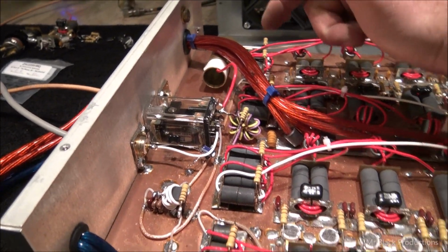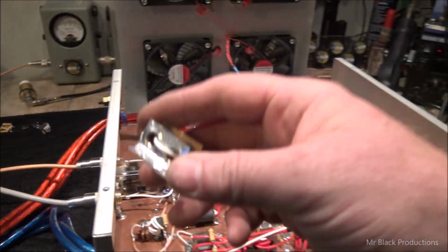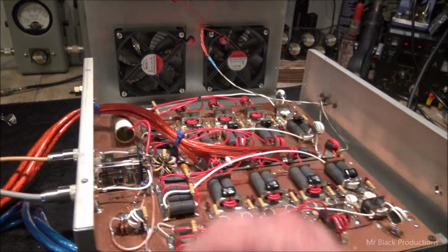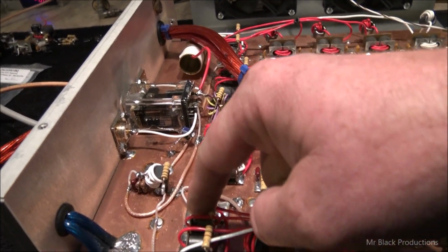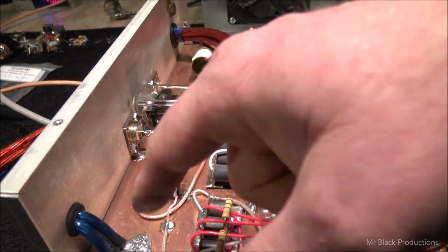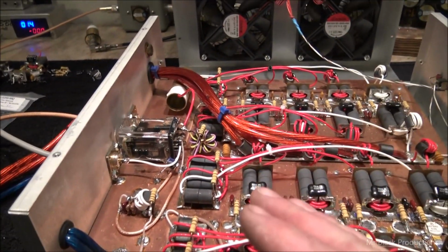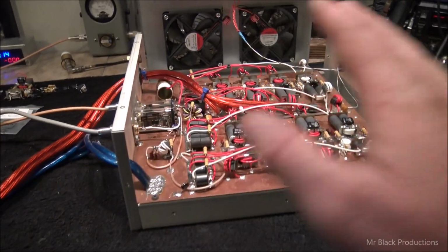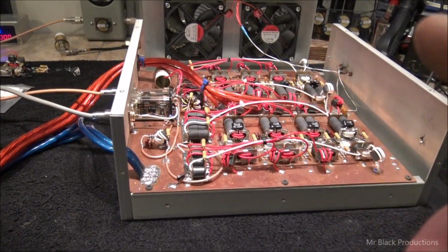The other thing that happened, Lee, is that I noticed from the stock primary splitter unit, which is like this, coming off, going over to this input splitter, the coax is about 3.5 inches shorter than it is this way. If you notice, the coax goes all the way across. I made those even, and I'm not saying that in any way other than I just made the coaxes even. And then I figured this out.